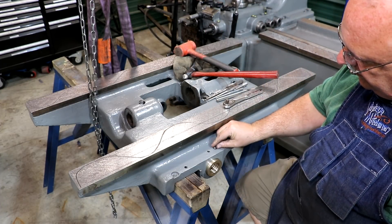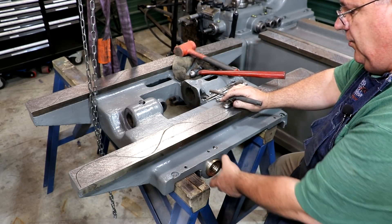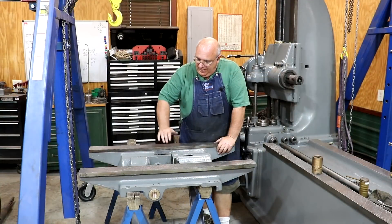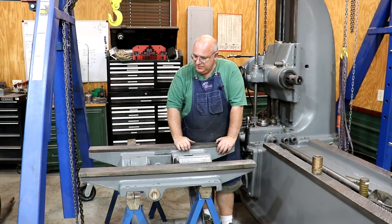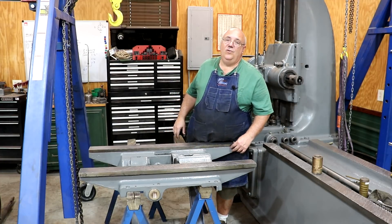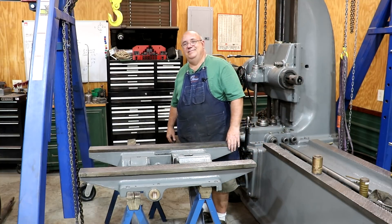Let's see how this fits - that's going in there, oh that's going to be perfect. I'm going to just tap that in place. There we go - that is locked in there now. That will not rotate nor will it move in and out. It is keyed into this and this job is done. With that, I think it's a wrap. We've got that new bushing all installed, ready to go back together, and actually this whole saddle is now ready to reassemble and go back onto the machine - that would probably be the next step on this project. Been a fun little project, hope you enjoyed watching us make that new lead screw nut. Thank you guys so much for watching - please subscribe to the channel if you haven't already, thumbs up and comments are greatly appreciated, hit that bell icon to get notifications when new videos are posted. We will catch you on the next video - thanks for watching.